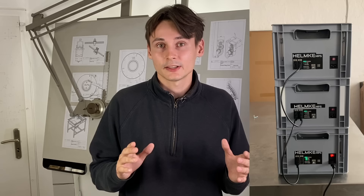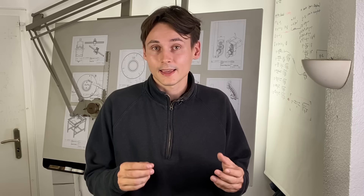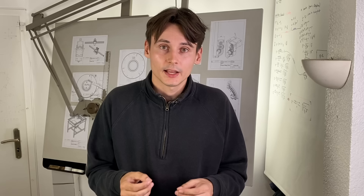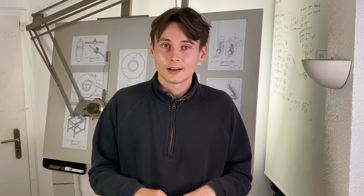However, daisy chaining definitely comes with its own challenges. First of all, the power supply in the bottom feeder has to be powerful enough. Second, and really important, the cable itself has to have a sufficient diameter to handle all of the current. What we could do is simply use a higher supply voltage — like 48 volts — and that would allow us to carry twice the energy over the same cable diameter. However, this comes with its own set of challenges, and I don't really think it's an option here.